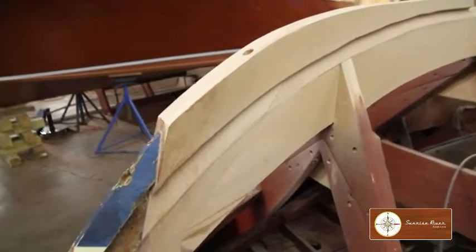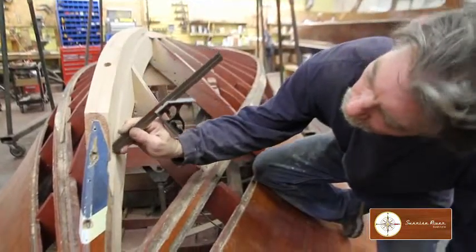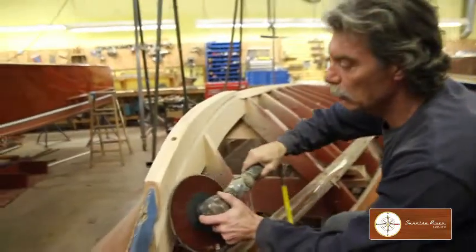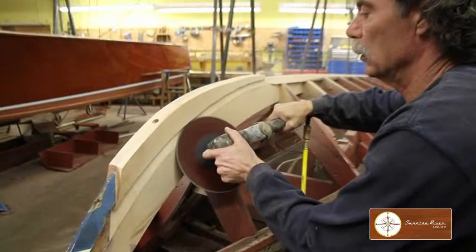As you can see, the bearding line is all in place. Rather than going at it with the grain changes using a chisel and mallet, we found that the grinder is probably a much faster way to do it, and it also provides a much fairer curve as it's a changing bevel.